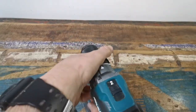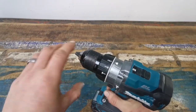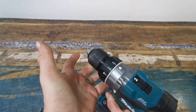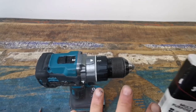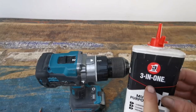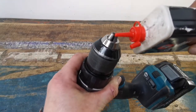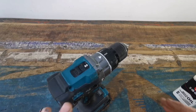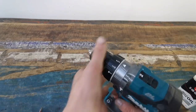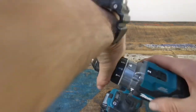Right, that was a right carry on. And it can work the other way as well — if you tighten up onto a little bit and run it right to the end like that, and then try to loosen it, it jams. That stressed me out a little bit. What I'd say to mitigate that is every so often put a little dab of 3-in-1 oil in the chuck, just over the jaws. Just a tiny little bit, let that soak in a little bit. If you do that on a regular basis, it won't jam.